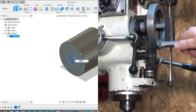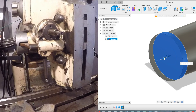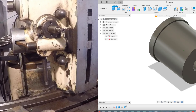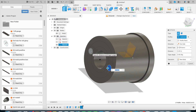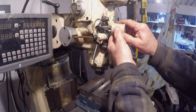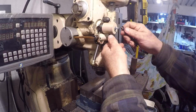That's why these things were removed in the first place — if you look at most mills, they don't have these on them anymore; people took them off and threw them away. If you look at the mill, there are two holes in the fine adjustment, and I also have that bolt that pulls out and in. This thing needs to do both: pull out and stay engaged in those two holes, but when I push it in, it can't bottom out because it has to push in to engage. I know this thing looks a little hokey but I think it's gonna work. It's a really tight fit — let's get it into place.